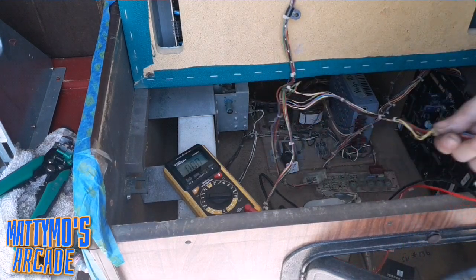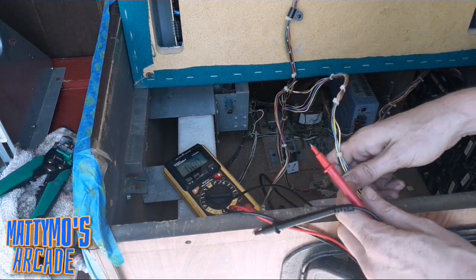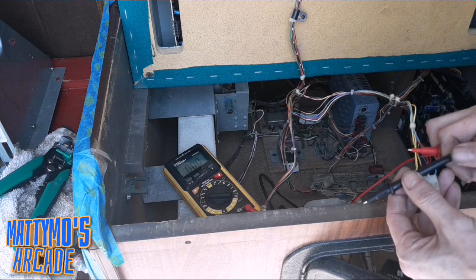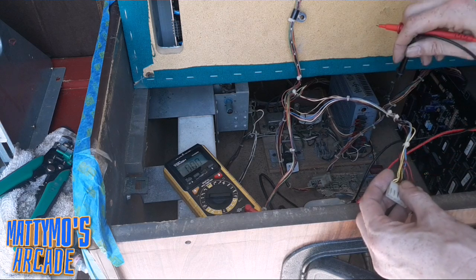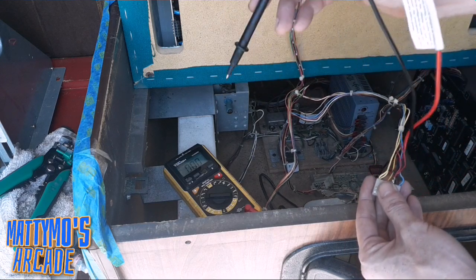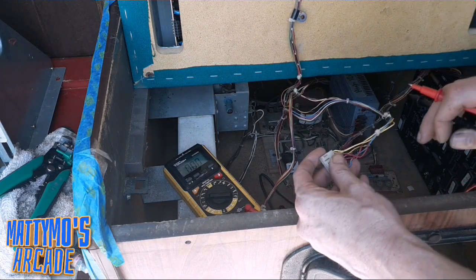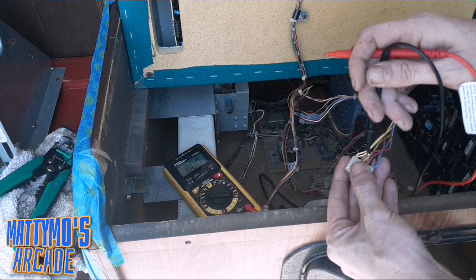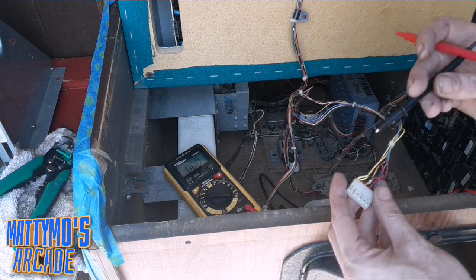And if you're watching and you have this problem, your sensors aren't working, and I tested the power supply. It's putting out 5.1. All the voltages are correct out of the power supply. We just need to check this. The problem I read on the forums is that at the sensor it needs to be 5.1 volts itself, and so people are turning up their power supply so much to get that 5.1 through this and then around to the other connector that they're frying their board to get it that high. And so my plan is to run a separate wire straight from the 5 volts on the power supply and jump it straight into this wire, and if need be, jump another one straight into the other connector. That way it's not going through the board and it doesn't get as much voltage drop.